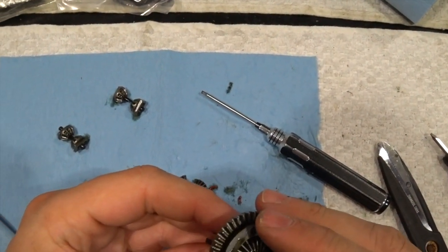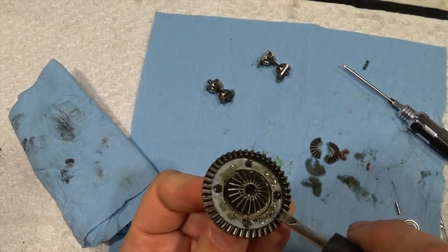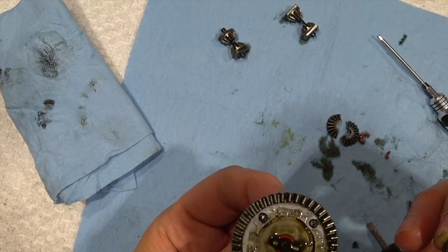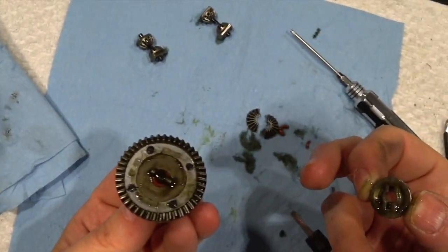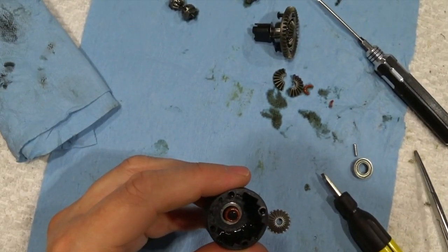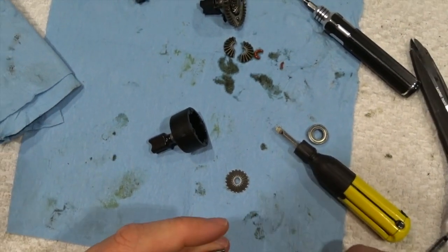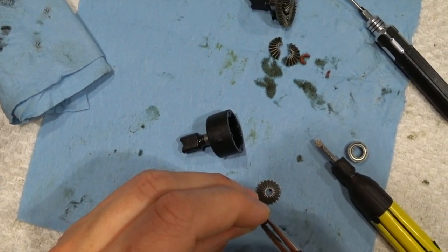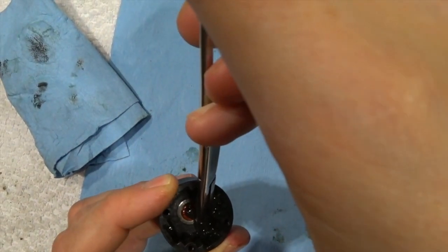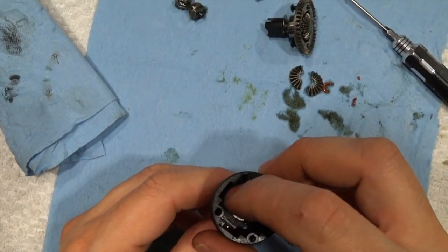If you don't know, look on this side, because this side will be the same way it's built. Okay, so the pin rides on top of the O-ring. It seems like a big wear point. So it's O-ring first, over the shaft. Pop that down in. And then your pin. I always find getting these pins in is difficult. This is where this tool becomes very useful, because there's really tight tolerances in here. You're going to get that in, slip it in, just like that. I was surprised that that pin rides on top of that O-ring like that. I guess that's just how they've designed it.